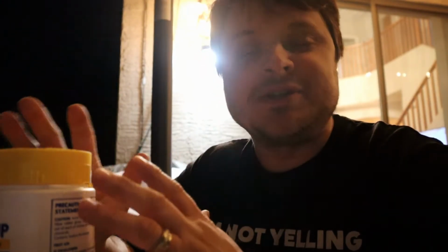What it says here is 1 1/4 ounces of this Alkalinity Up added to 500 gallons of water will raise the total alkalinity by 10 ppm, or 10 parts per million. I think earlier I accidentally said that the Saluspa Laguna, the one that we have here, holds 1,500 gallons of water. That is way off. I think I was getting the number of how much it weighs. It weighs, when it's full, about 1,500 pounds, so it's pretty heavy. It holds 177 gallons of water, I believe.